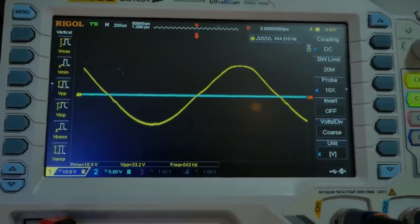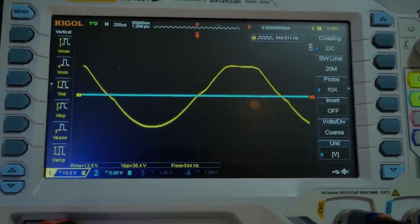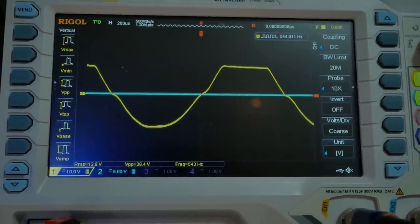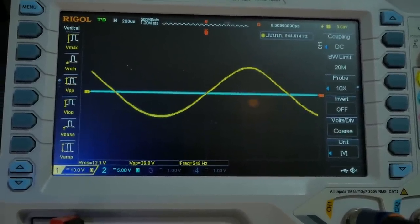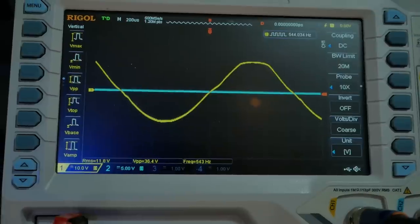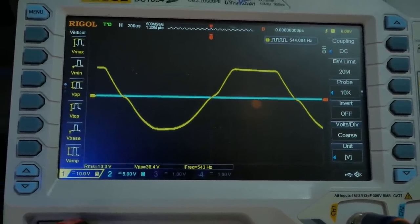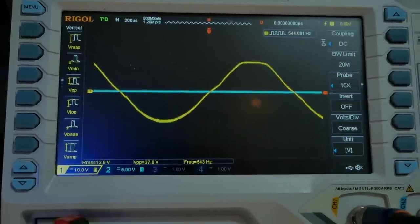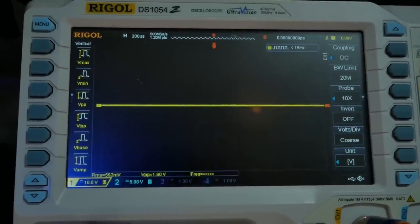Now I've got an Electro-Harmonix I just had floating around in there to test out. You can see it's going up to about 13 volts before you're getting the distortion. It is asymmetrical distortion, but that's one of the things we're going to change in the phase inverter. Make it a bit sweeter. But yeah, we're getting more power there before that crazy distortion comes in. That's the kind of distortion you expect from the cathodyne phase inverter in this configuration. So yeah, shitty JJ. Oh, and shitty Panny Boy focusing.